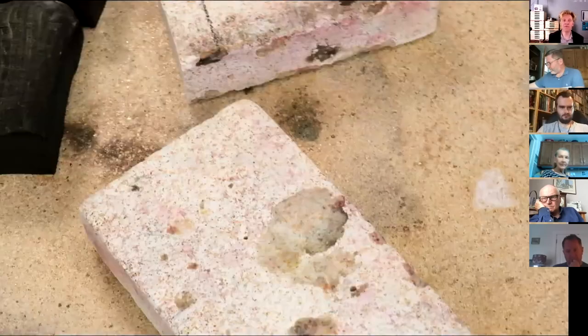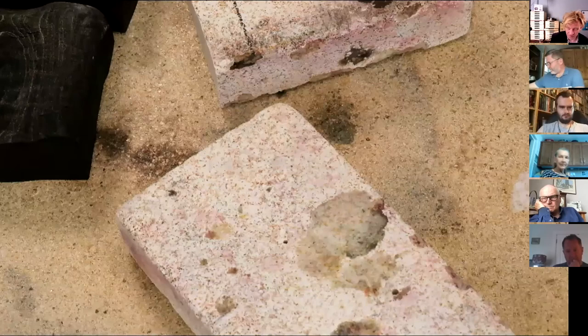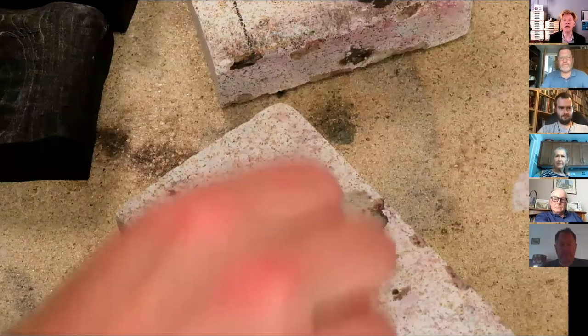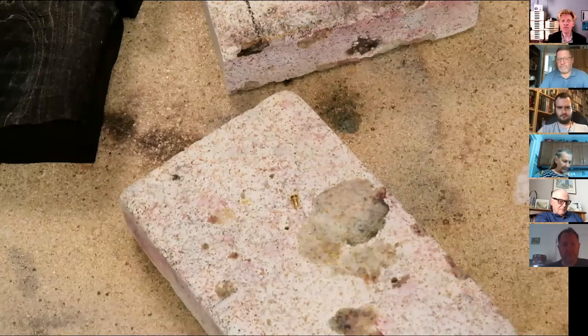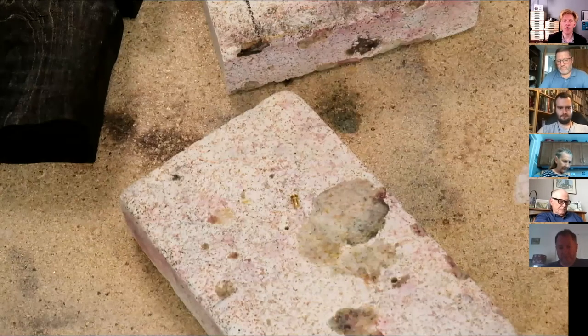So to anneal brass, that's to make it softer when it's been hardened. Brass, as you can see there, is hardened by working it, brasses and bronzes and so on, and I think aluminium as well. And so if you want to change the properties, you either hammer it or roll it or draw it or something like that. And this has been drawn when it was made.